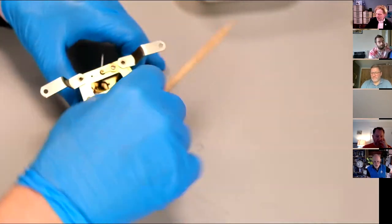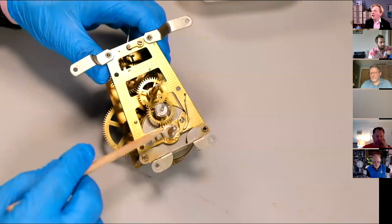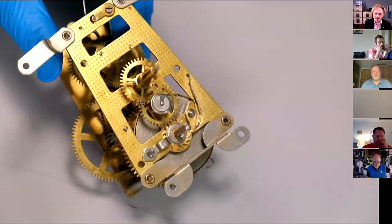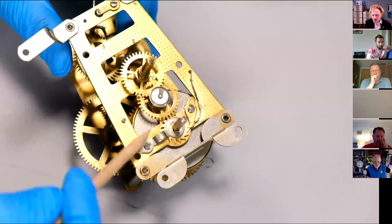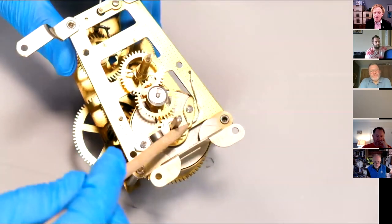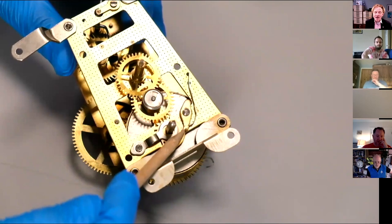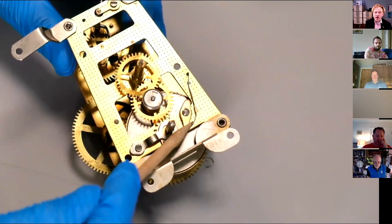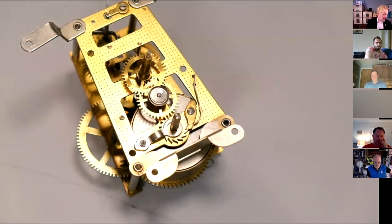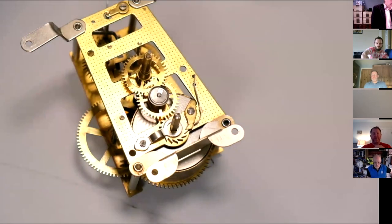Still looking around for my winding key. On the front of the mechanism, down here, we've got maybe the most important part of the whole thing. We have three components here. One is a wheel with asymmetric teeth. The other is this little mechanism here called a click. And then there's a spring here. And I'm just going to take a couple of minutes out to find the winding key, which I did get and was organized, but have lost it.